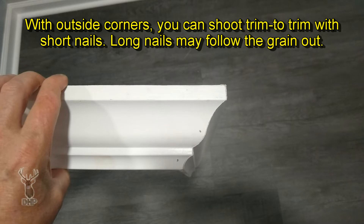For painted crown — which is usually finger-jointed anyway — hold them together at the joints and use just a minimal amount of caulk at the joints. I cut a 13-and-a-half-foot piece twice and was down to my last piece of whole trim, so I decided to deal with a very small gap — not perfect as I'd like, but good enough for government work. Overall it's not too hard using those two tools in that fashion.